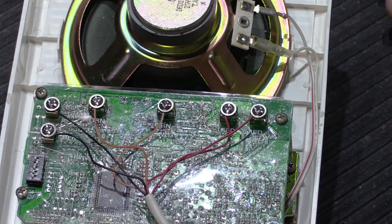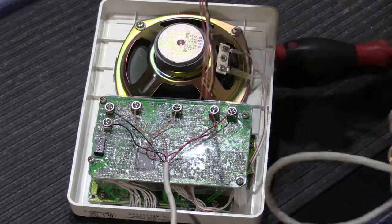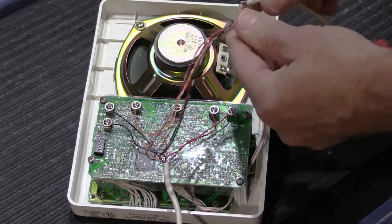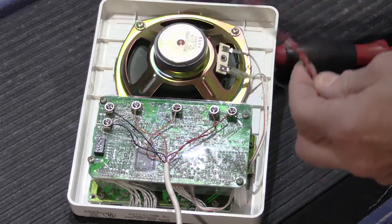So how do you do this when you're looping? Looping means you have your incoming cable, but you're also going to have a second cable — your outgoing cable that's going to continue on to another room down the hallway. So you have two sets of wires under each screw. Let me show you.